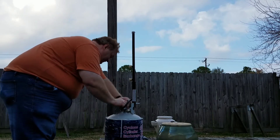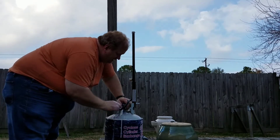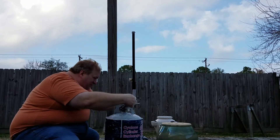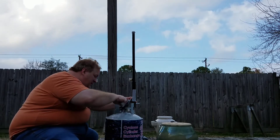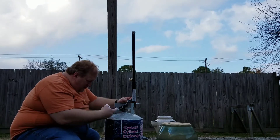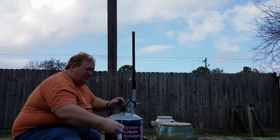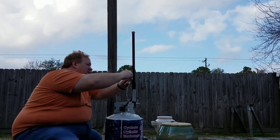Since this is a new-to-me distribution post — I bought it on eBay — I want to check for any leaks along the hose as well as where the hose connects and all of the connections. The best way I can describe it is you're looking for any bubbles like kids make with bubble wands — that's what you're looking for.